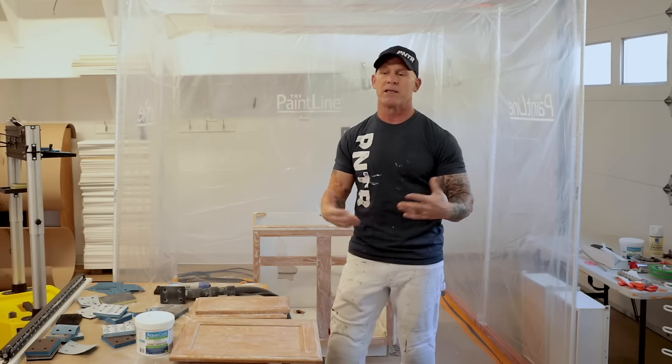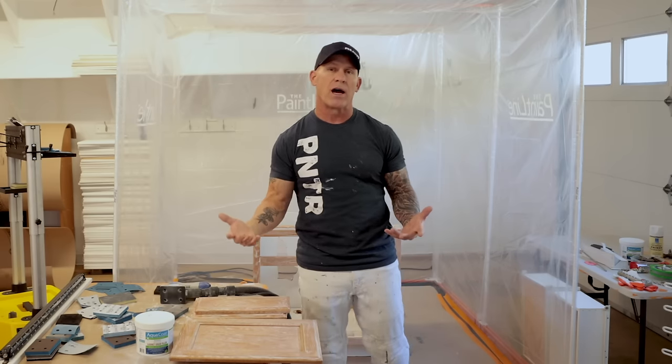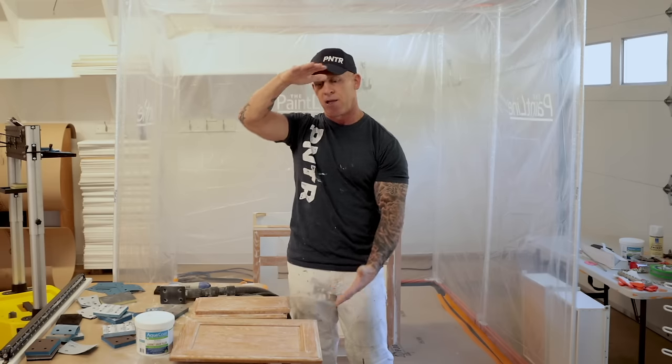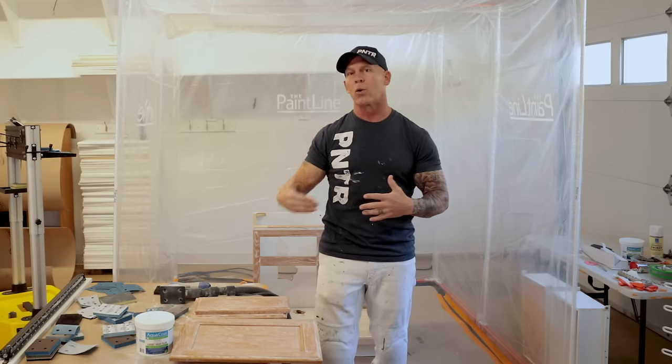And what I actually do is I break that side panel up into door fronts. I look at a side panel and an average size door front, I'm gonna say it's about this big, and I'm gonna say how many doors would fit in that panel. For the one panel we'll see, it's about four door panels. We'll cover that whole side refrigerator panel. So I'm gonna call it four door fronts. And that's how I deal with really large panels.